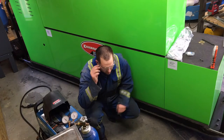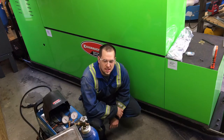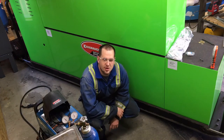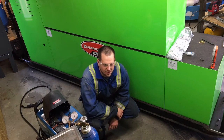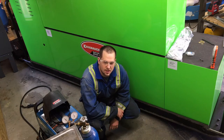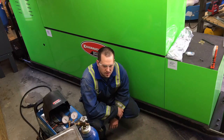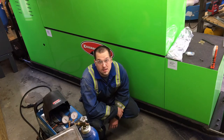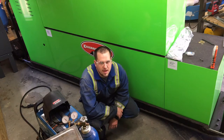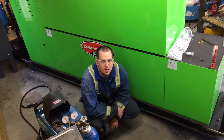Showed you guys a thermal image from one of the tools that I have of the air compressor. So it was right around 105 degrees C. That's after it running straight for 20 minutes. Now you're not supposed to do that with these three stage compressors like that. A twin screw air compressor is good. I was gonna buy one of those before I slowed down in the mechanic business. So I still got this. I do plan on putting three more fans onto this compressor just to keep it cooler. Just because the cooler it runs, the less condensation and so on and so forth in the air.